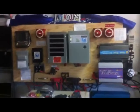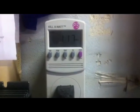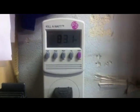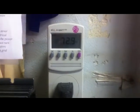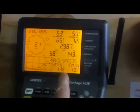We're in control central here. There you see my wind controller in divert mode — it's dumping into this grid-tie and there's the watts coming from the wind. This is dumping just the wind — that's 123 watts there. It's not dumping off my battery. I actually rewired my charge controller, as I showed in another video. There's 150 watts — whoa, 176 watts! Let's see what kind of wind we just hit there: 19 miles an hour. That's your average over the last two minutes: 15 miles an hour. We hit 21 — I just missed it. It's about a one-and-a-half second delay.